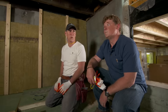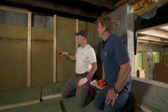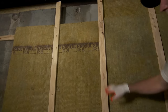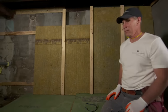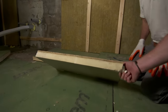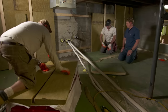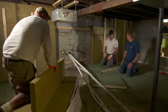This space will just become basically dormant, but it can be a place for the heat in this house to leave if we don't do something about it — heat will go through the walls, even through the floor. So we've attached two rows of furring strip around the perimeter of the existing wall, and then we're going to attach mineral wool to it, which gives us R8. We're holding it in place with another furring strip in the opposite direction. On the floor, we discovered the same system we used on the wall is a good surfacing to go over the existing slab — sheathing and insulation as a one-piece. We'll tape the seams and put another layer of plywood down to lock it and clean it up.